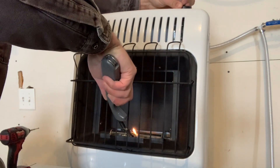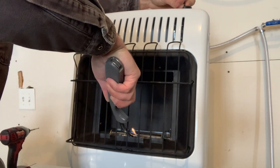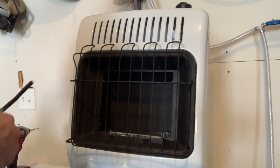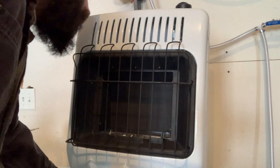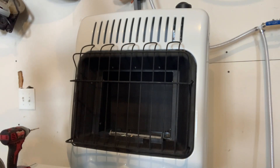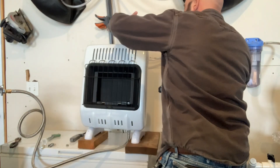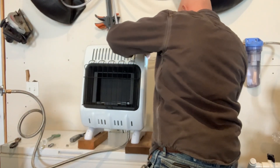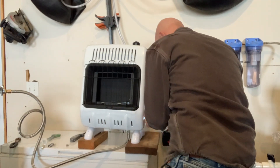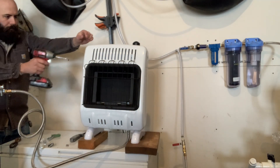What's happening here is pretty interesting. It's pushing the flame around the pilot, but the gas is not igniting, and the reason for that is the gas is too lean — it's mixing with air through a little manifold in there, so it's not able to light. To make that adjustment is no problem: we just have to take the face of this thing off. There are two Phillips head screws on either side, four total. Once you get those out, the face will slide off — you've got to kind of whack it on the bottom and push the face upward and it'll come off.